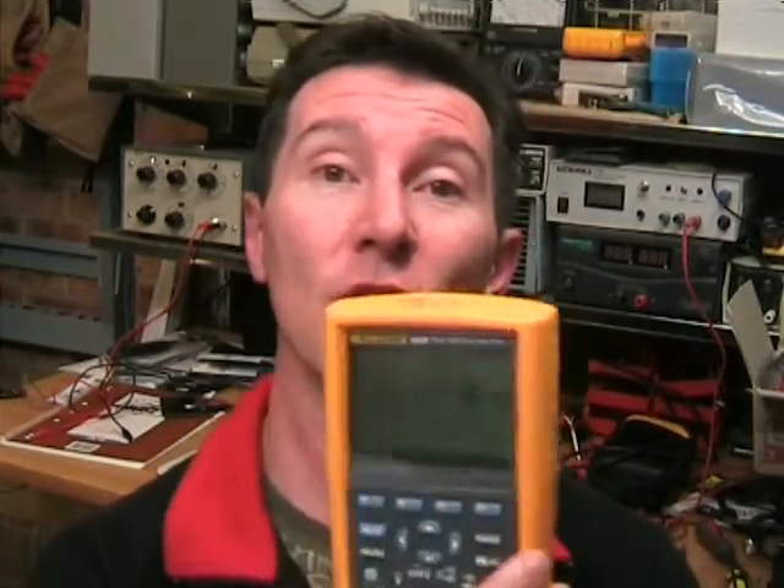It's actually got two processors. One is a TI MSP430 - the famous ultra-low-power TI MSP430 processor. And that's really cool. But that's kind of surprising why this thing draws so much current, because it's only got 100 hours supply on six double A's, and it uses the famously low-power MSP430. So I don't know where all the power's going - maybe it's driving the display or something like that. The other processor is a Motorola MC9328. And that's got external memory and external flash and things like that. Presumably the external memory is the storage memory. Yeah, it's a dual processor thing and it doesn't rely on an actual Fluke proprietary processor at all.